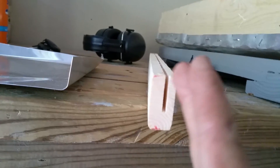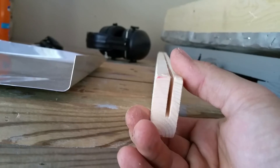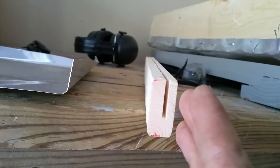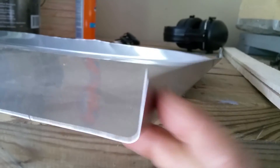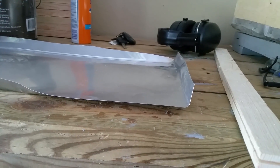Now the closer you get, the more weak your metal brake is going to be. So you're just gonna have to experiment with how far you can go in this direction without getting to the point where when you bend it over, this wood snaps. But for me, this is an acceptable substitute to not have to spend $24. Thanks for watching and keep looking out for some more tips.